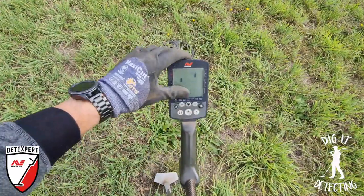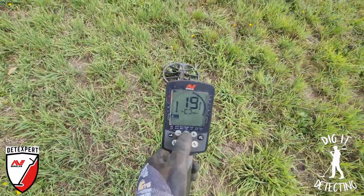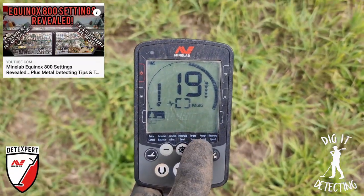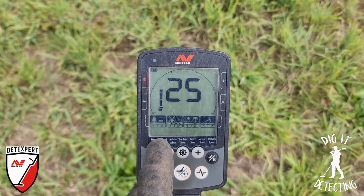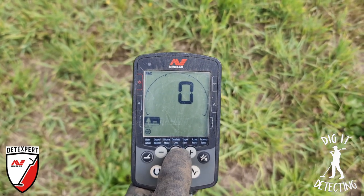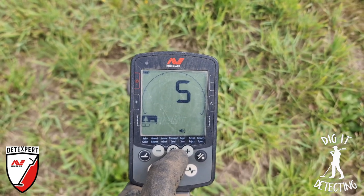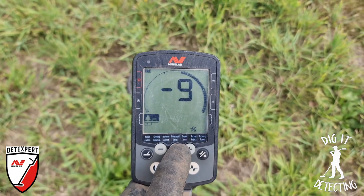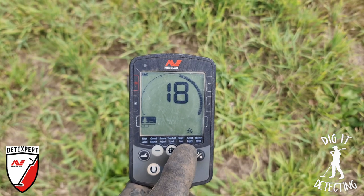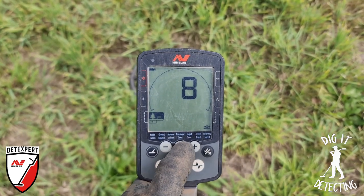Let's get it flicked on and see if it still works - it has not been turned on in the past month. I cannot wait to hear those tones. Some will know how I have my Equinox 800 set up. Those tones with my coin settings sing out nice and loud. At 24, 25 - we'll bump the sensitivity right up. We're in park one mode. We'll do a quick run through and knock that back down and do another noise cancel. Ground balance zero, volume up, threshold to zero, target tone on five - exactly where I like it. Just five tones, easy to listen to. We're going to be digging from 18 through to 40, still cherry picking this site.